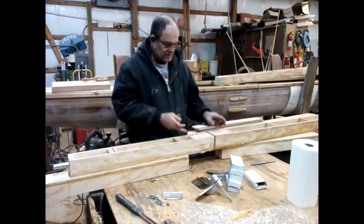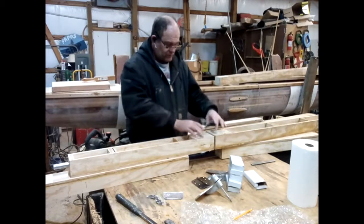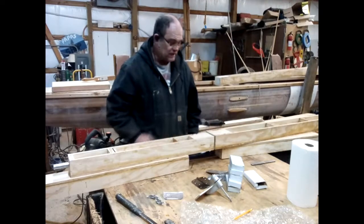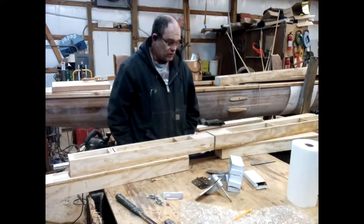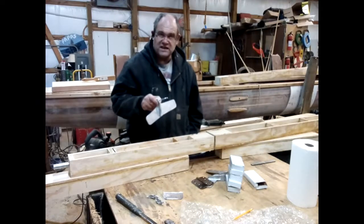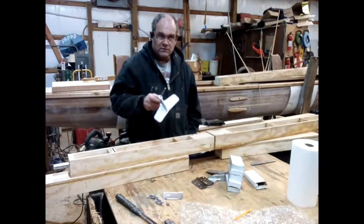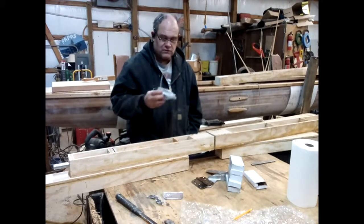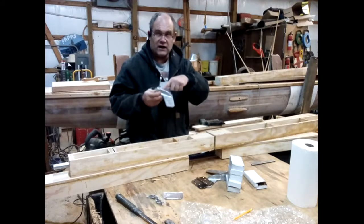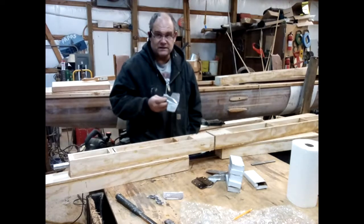And I also got some plate that I'm going to extend out 4 inches and then weld the actual hinges. So I'm going to actually make custom hinges for these guys. It will be stainless. It will be stronger than any possible impact loads. I really wasn't too worried about these guys as far as the static load of the float going through the water. But I got to thinking, when I slam into a big wave, there's a lot of peak loads there. And I was kind of concerned of inclusions in the casting and getting a crack right here. So I'm going to go ahead and weld them out of stainless steel.